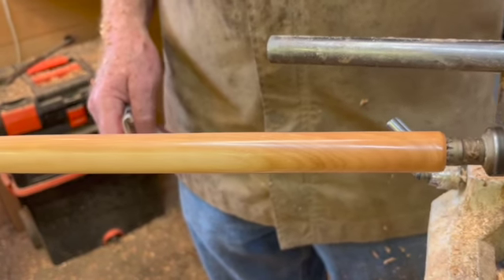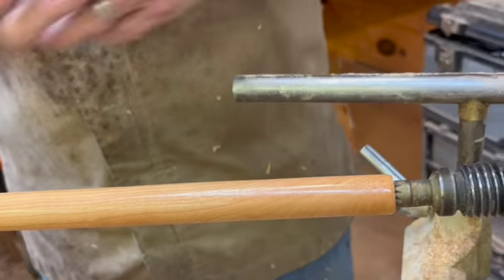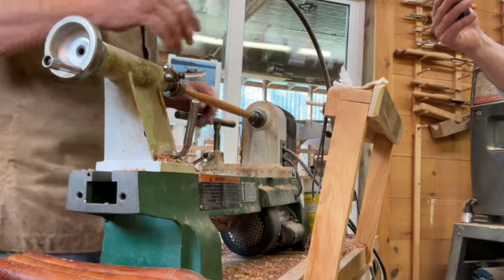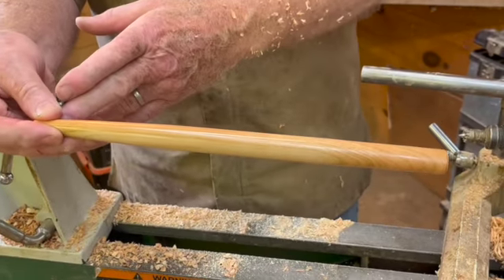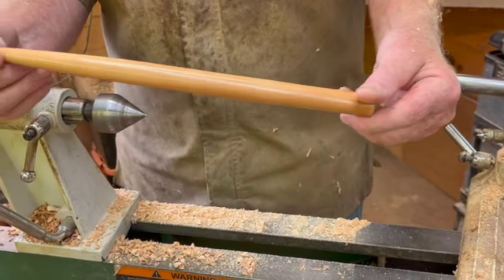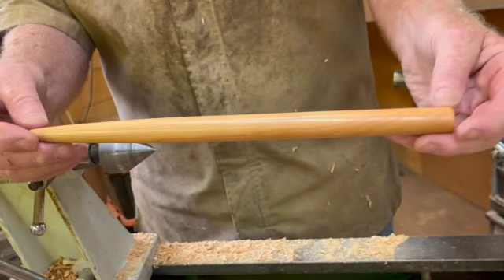So there is my cherry candle — a red one with a white splash of sapwood. I'll drill a little hole in the top and use some fine cotton twine as a wick. We can hope nobody's going to light it, because it'll just burn the wick — hopefully the candle itself will not burn. The grain runs between the centers of the lathe; I used a roughing gouge, a skew chisel, a medium-sized gouge, and a beading and parting tool to give it that shape.